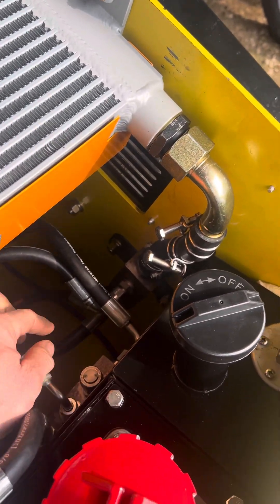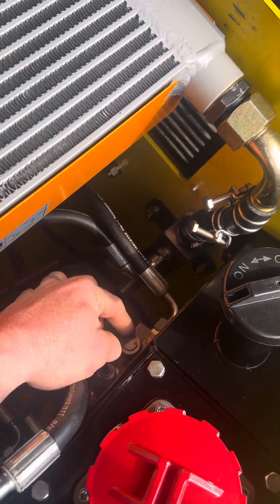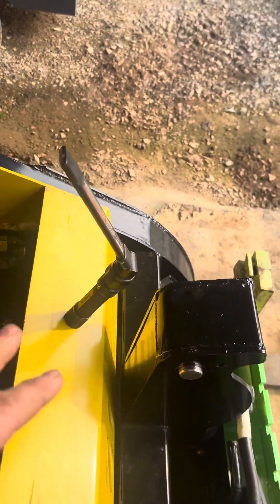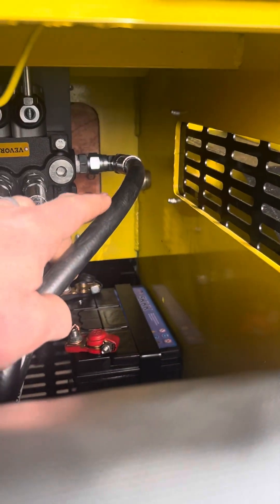We're not going to use that original feed, but you could later opt to use that return and feed for an auxiliary control if you decide to — it's already set up for that. Then the pump side line goes all the way down to feed off the first section of the pump off the back of the engine, feeding directly to the new spool valve.